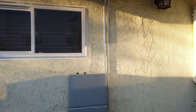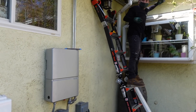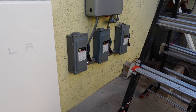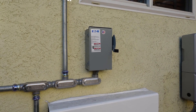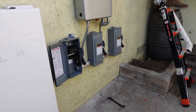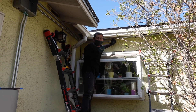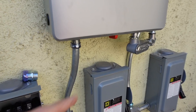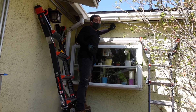Is this the inverter box? Yep, that's the inverter, and it serves as a means of rapid shutdown for a DC disconnect. They actually require you to have a DC disconnect for each string — it's a lot of equipment, but the NEC requires it. Is this for me, if something happens, I can go here and pull them? Yes. However, the fastest means — you have two methods. If you want to just disconnect the DC side, there's a red switch on the bottom of the inverter. You can turn that and that would shut it off, just in a second.